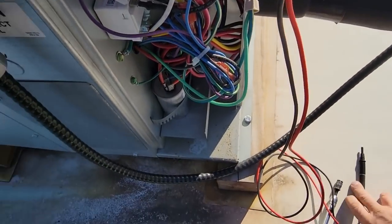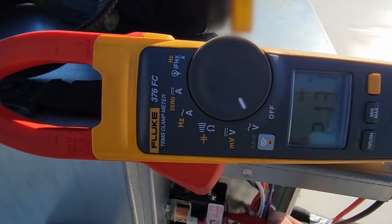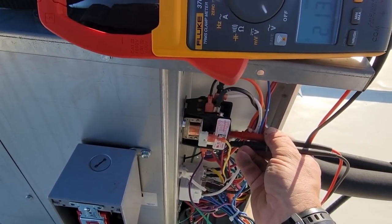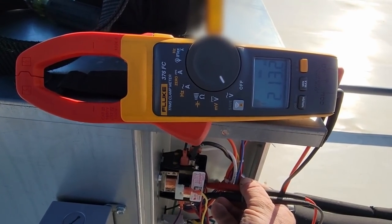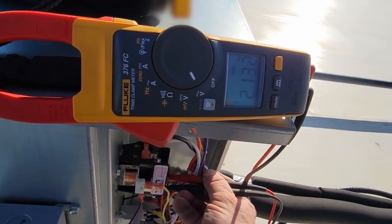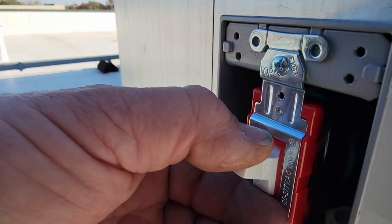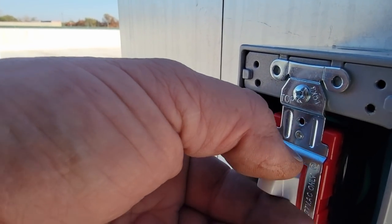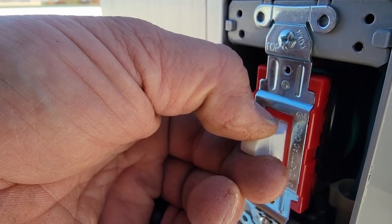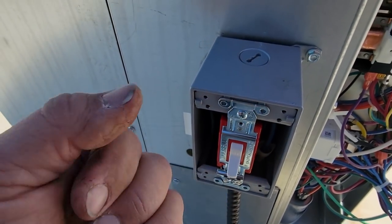I've got it flipped on — let's see if we've got power to the switch. So the bottom there, we do have 213 volts. We're going to flip the switch on and off a few times to see if it comes back every time, to determine if it's actually the switch or if that mechanism wasn't letting the switch go all the way into position. Just a little bit down is enough to disengage it — one leg's still hot, the other leg's not. I don't trust the switch. Even Hubbell has a bad day.